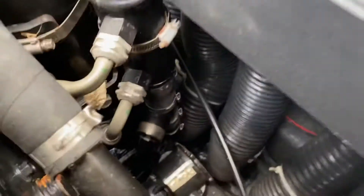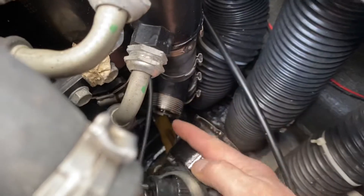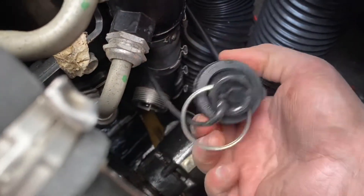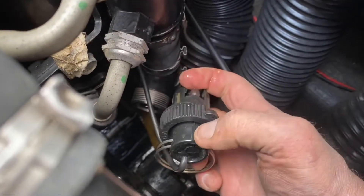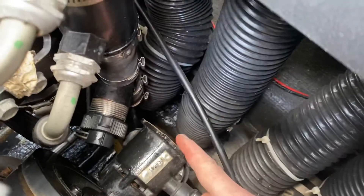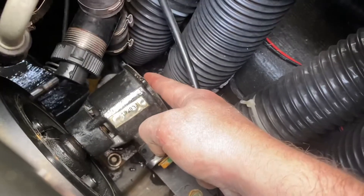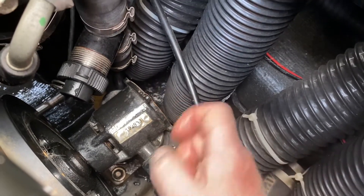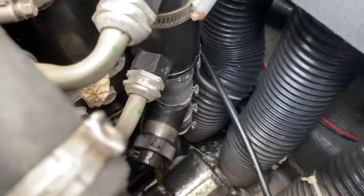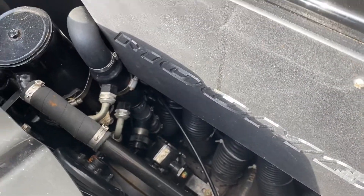The other drains are your paddle wheel here, which goes into the vertical stack that goes into the heat exchanger. When you put this back in, make sure that the arrow is going straight up, or else that will throw your check engine light. I've removed the plate off of the impeller housing so that drains. At the very bottom of this stack, all the way down underneath there, there's a blue plug — it's a little twist-off — which you pull and drain.